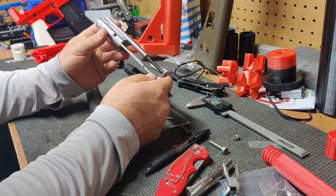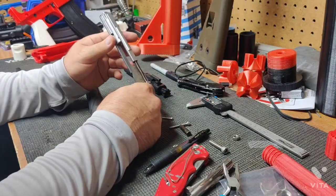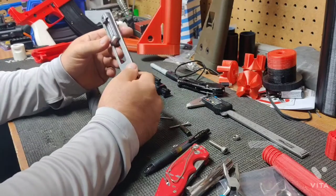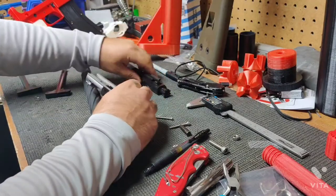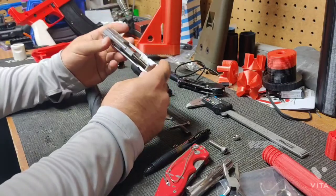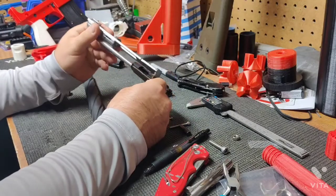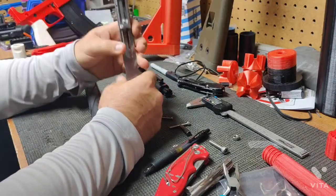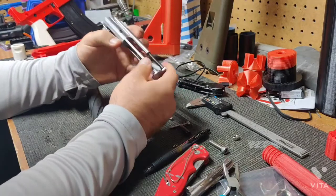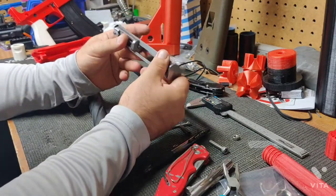In my opinion, you could make one of the 22 bolts at home. I don't think it would be terribly hard compared to making an actual AR-15 bolt. This would be something where, if you had one on hand, you could make alignment jigs to lay these pieces in and weld everything in place.